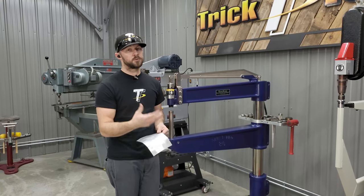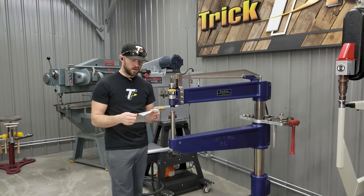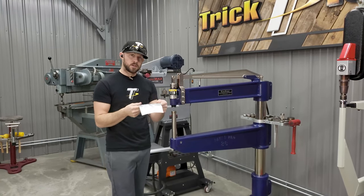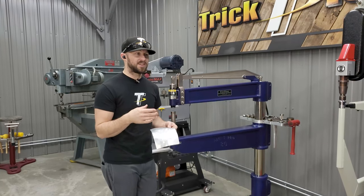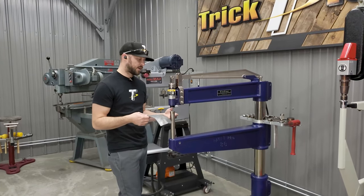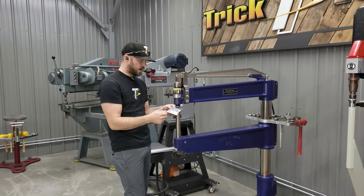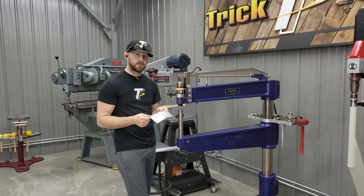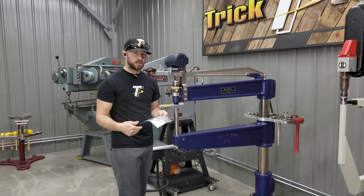My personal opinion is that English wheels are great for bigger parts. I wouldn't always want to go up to an English wheel with a smaller part and try to do all my smoothing and shaping with it — is it possible? Yes. Is it the most effective and easiest? No. That's where a planishing hammer comes in handy, because you can really dial in small areas without having to move the part back and forth aggressively like you do on an English wheel to achieve the end result.